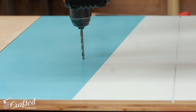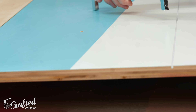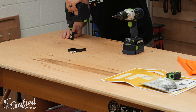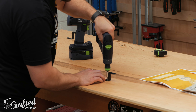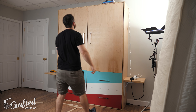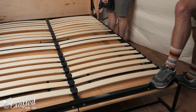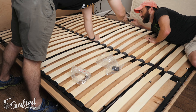Once the paint was dry, I could install the drawer pulls — a pretty simple process, just needing to make sure everything lined up correctly. I probably should have done this before applying finish so I could cover up any errors, but luckily everything worked out. To install the doors onto the Murphy bed frame, the kit includes little clips which need to be added to the back side of the door panels, attached with a few included screws at locations specified in the plans. Once the clips were installed, I dropped the door panels into place and adjusted them so there was an even reveal around all the edges. You can see how the final placement gives the illusion that this is a cabinet and not a Murphy bed, especially with those drawer pulls added. After getting the doors in their final location, the door panels are attached to the bed frame with longer screws through the inside of the frame. Finally, I could add those slats I had left off earlier, install the mattress supports, and the Murphy bed was done.